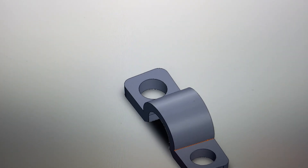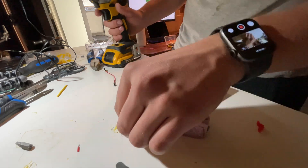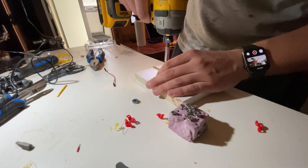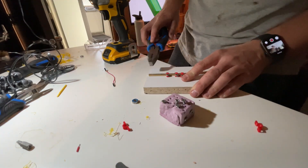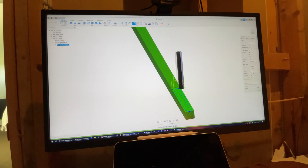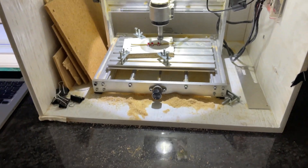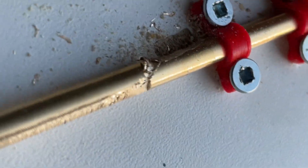Then I shifted gears towards the shafts. You know when you have an idea in your head that you think is going to work out amazingly, you put in all this effort to design and think it through, and it ends up just being a total nightmare? My three brain cells decided it was a good idea to try to machine the shafts on my crappy little CNC machine. I made some brackets to hold the shafts down onto a piece of wood, made some G-code to cut them to the desired size, and put it on my machine. What ended up happening was that the shaft moved, the machine crashed, and it caused just a huge mess.